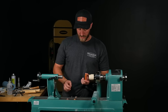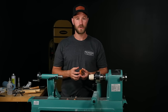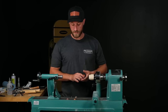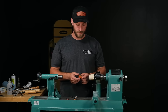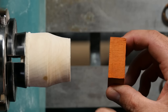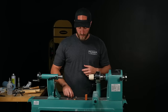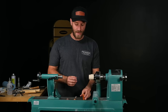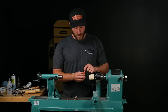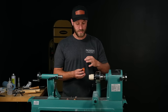One consideration for the material is I want it to be stabilized. Stabilized wood is going to be a lot more durable long-term — it's not going to be affected by moisture, like if you forget to take your ring off while washing your hands. So definitely pick a stabilized wood. The other thing I really want to consider is how open-pore the grain is. Those open grain lines are really important because when we snap this blank in half to fit it around our core, those open grain pores hide the seam a lot better.